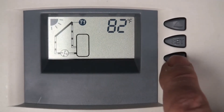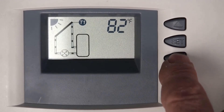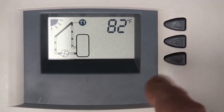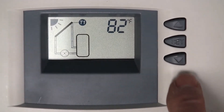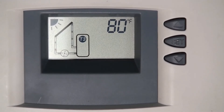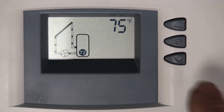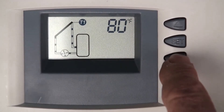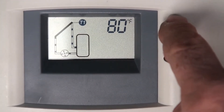When you look at the controller, you can set the icon position to any sensor using the down button. You can have it set for the middle of the tank, the bottom of the tank, or the roof — whatever you prefer. It'll stay where you leave it. If you leave it at the bottom and the bottom reads 120 degrees, you have a full tank of hot water. Pressing up or down just scrolls through the positions in opposite directions.